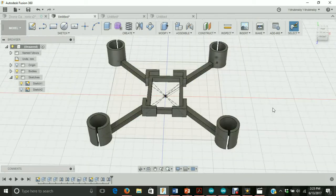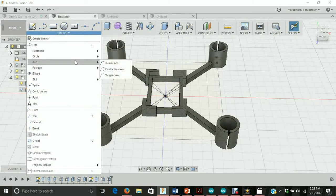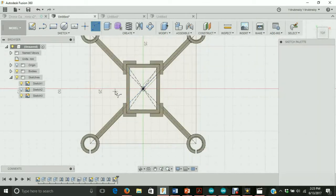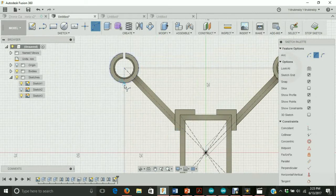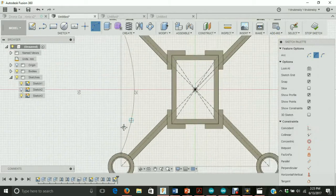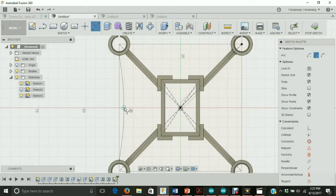The last thing I want to do is create some arcs on the motor holders to give these arms a little more structural integrity, making it harder to break in the event of a crash. Let's go to sketch, arc, three-point arc, and we're going to create a sketch on the bottom plane. Let's select the intersection of the rectangle and the motor — you can see the X and the triangle. Let's click there and do the same thing down here, then control the radius of our arc and eyeball it to about the 25 mark.